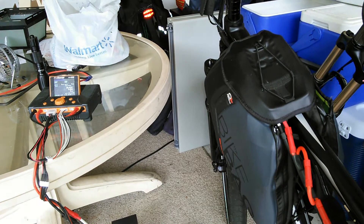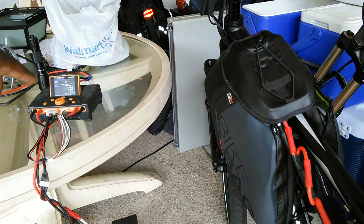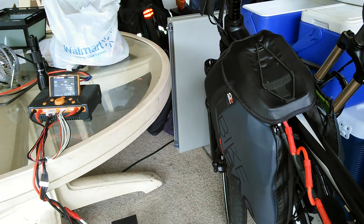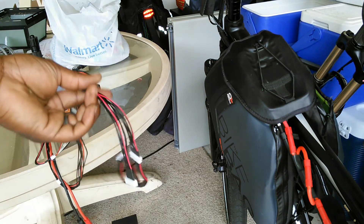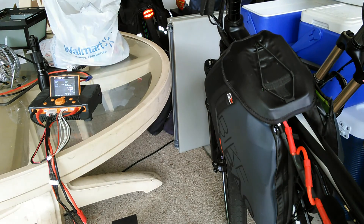That's all there is to it. It took me three hours to make the harness, but you see how much it simplified everything. I could undo everything, hook it up to the charger, and redo everything — it's like 30 seconds to tear down and hook up to the charger, and 30 seconds to reassemble. The series-parallel harness is much better. You don't have an excuse not to balance charge these packs. The only thing you need to make sure: whenever you disconnect from the charger, disconnect your balance taps first before you plug in your series cable — because if you don't, you'll fry your harness. But other than that, it's really simple and easy to do. Thanks for watching.